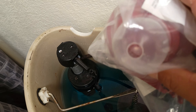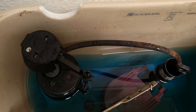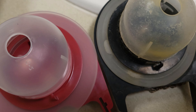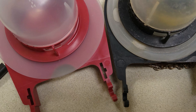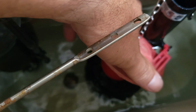I had already gotten the flapper when I went to my hardware store, and I had the right one to replace it with. They are different sizes, so make sure you have the right flapper before you do this. To change this flapper is really, really simple — I'm not even going to shut the water off. As long as your toilet is not clogged, you should be okay. As you can see, comparing the new one and the old one, you can see the blister — that was leaking. Pro tip: if you wear watches, don't stick your watch in the tank because porcelain will scratch it, so make sure you take it off.